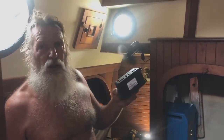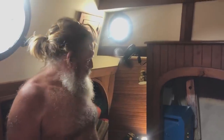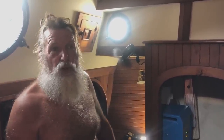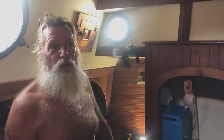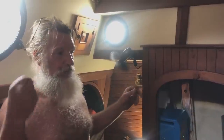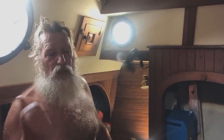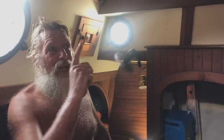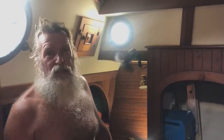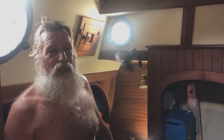This is the Cerbo, yeah. So it's all going together today. You mentioned solar panels. Yeah, just bought three new solar panels, a big 400 watt for the back, and 220 watts for the sides, adjustable for the sun, because I put the solid top rail on, as you saw in a few episodes ago. And then we've got our existing 320 on the roof and 200 on the deck. So it'll give us five panels, which should be enough solar to run everything we need without ever starting the engine again, apart from propulsion.